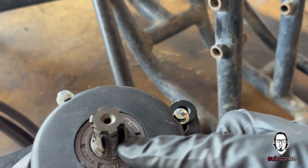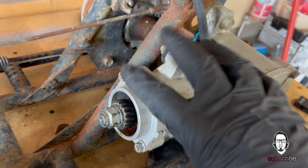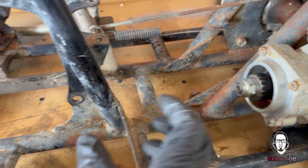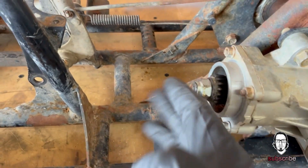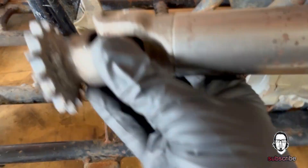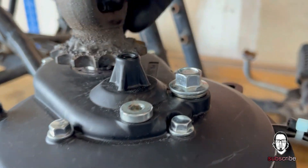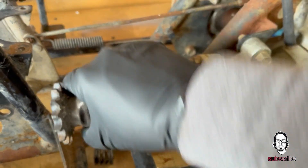Here's the motor — it has this spline drive, you can see it's got six or seven splines — and I need that to fit around the spline for the shaft drive on the four-wheeler. Since I couldn't get a custom piece made that would have positioned the motor further back for an easier mounting spot, I took the chain sprocket that fits on the motor. Line it up, fits on there and spins. Now I have my adapter that fits over the spline.